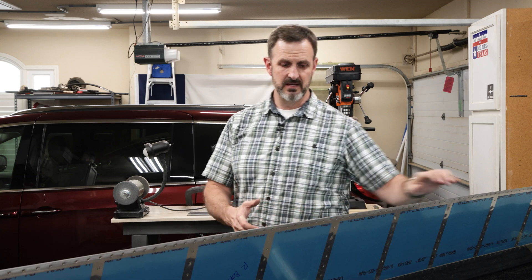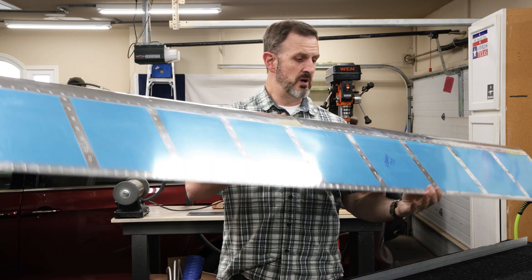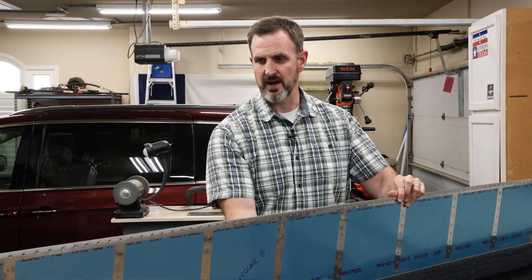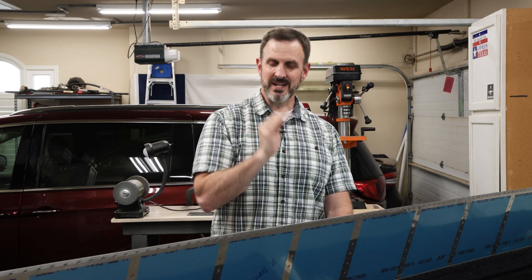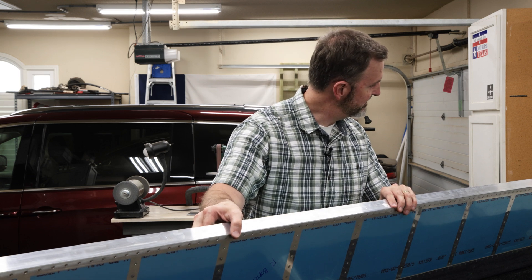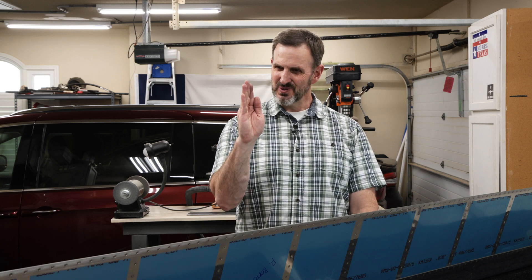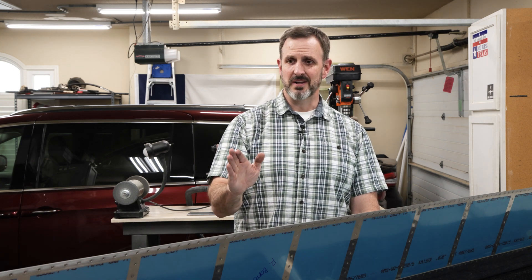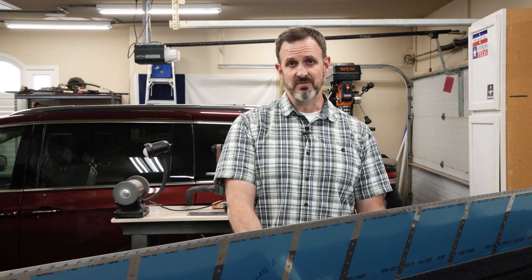That's it — I have finished making the right flap. I've also done the left flap a little bit earlier. Overall I'm happy with how it turned out. It's really lightweight. Generally everything came together the way it should. Looking down the trailing edge it's pretty dang straight — it's off maybe by 1/32nd of an inch, which in one way is not so bad but in another more accurate way just drives me insane. The left flap is pretty much perfect. This flap has a few very slight waves in it, which is probably normal but drives me insane — anyway, nothing I can do about it. It turned out well enough. The next video I'll probably finish up the ailerons and then we'll go from there.